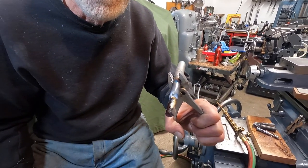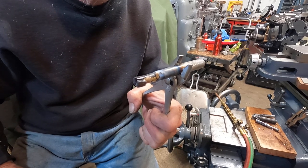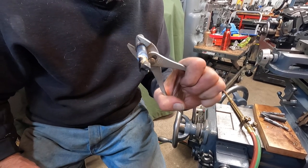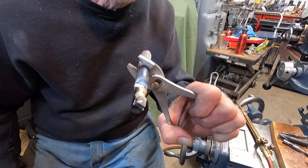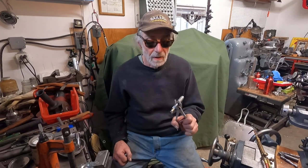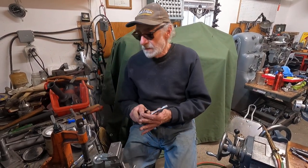Little scrapers like this are real handy. There's actually a guy on eBay selling these things — brazing carbide onto little pieces of metal, square stock even — and they're really useful tools. This used to be really common back in the 1980s. It seemed like everybody did this, and then people got more used to using carbide inserts. So you can make all kinds of tools.